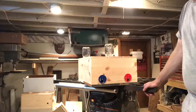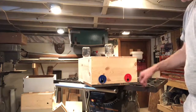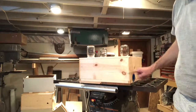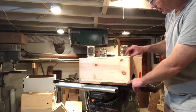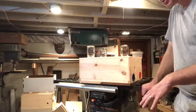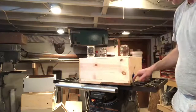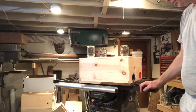Pretty basic construction — first thing you do is build the box, and I've got a video about that. It's got a permanently attached fixed bottom; there's no reason to have an opening. It's a very temporary home. This is a one by eight, which is seven and a quarter. I added three quarters of an inch, so the total chamber depth minus the inset of the inspection cover is eight inches. You lose a quarter inch for the dado — seven and three quarter inches for a six and a quarter inch frame — giving them a little room on top to get to the feeders and a little room on the bottom. I tried to put the entrance low enough that they could drag out their dead. Anyway, this is a fun project.